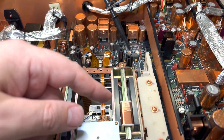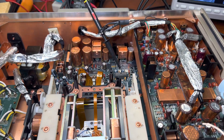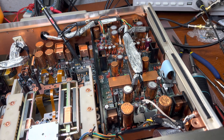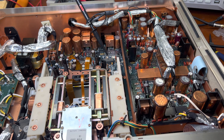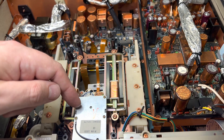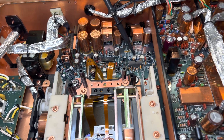Something looks severely broken and I don't have schematics, so I don't know where to start. This is my first attempt to work on a CD player. I'm not sure about multiple things, but it looks like it might just be parts. The motor doesn't spin, and I've read that the motor won't spin if the laser doesn't respond, so my only guess is that the laser doesn't work.